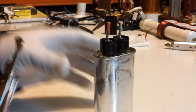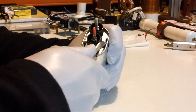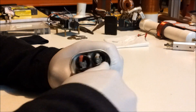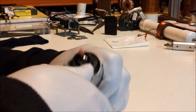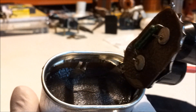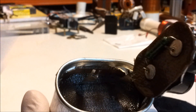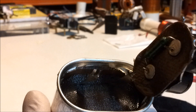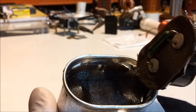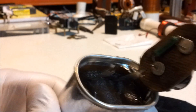Ready to open up. I've already removed the oil from about 10 of these. So that's what's inside these 2 kV microwave oven capacitors. You've got your windings in there all wrapped up nice and tightly. You get maybe 10 to 20 ml of oil in these things per capacitor, so there's not much oil in them at all. But you don't want to open them up and have oil dripping everywhere, so it's important to drain that first.